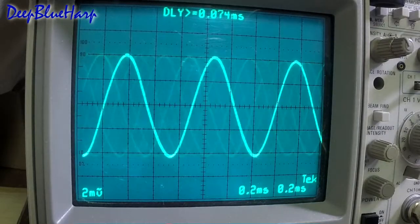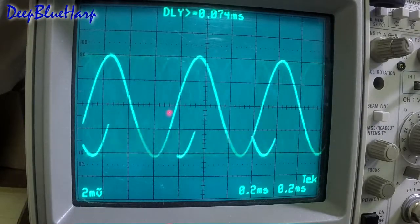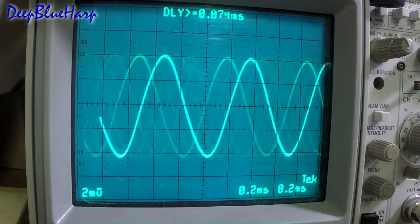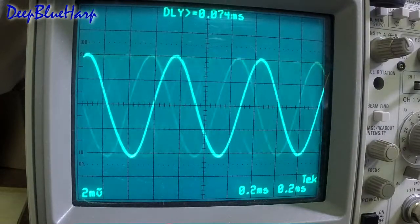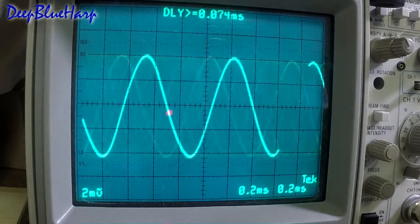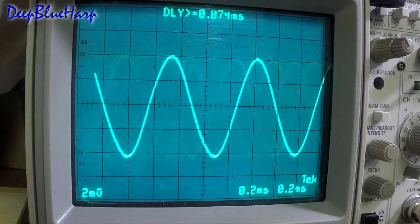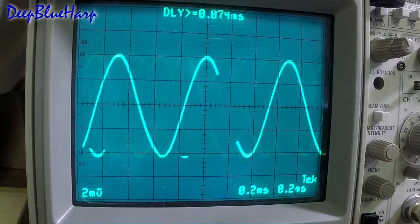That's the two ways of going about this. I like the oscilloscope better because I can see what I'm doing more clearly. When I hit that one spot on the left potentiometer it was glitching — you could see the glitch. On the digital volt-ohmmeter, if you're paying attention to the AC volts being measured out, you can start seeing it jump around. But either way is good — both tell you the pot's worn. Now what remains is you need to pull the board and repair the pot.